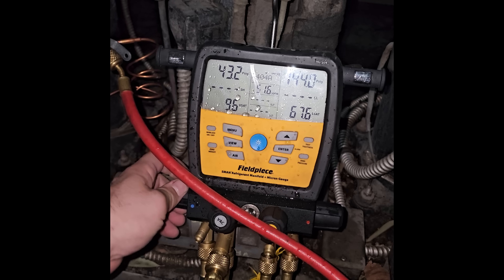It was actually so cold outside that we were having pockets of liquid refrigerant stuck all over the system randomly releasing. I knew there was 14 pounds in there, but I could only pull out 13 and some change. When we pulled the dryer out, even though my gauges said zero PSI, we got a puff of liquid. There was still liquid refrigerant in different little places, displacing any potential atmosphere. I was really quick about it — changed the dryer, added the dual pressure control, never really let atmosphere enter the system, it was all in positive pressure. Per EPA guidelines, when you recover refrigerant you pull down way into the negatives to get all that trapped vapor and liquid pockets out.